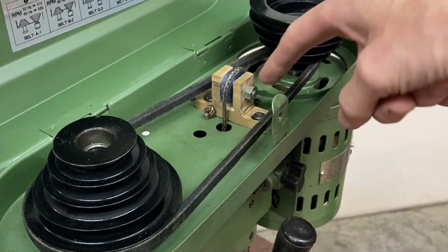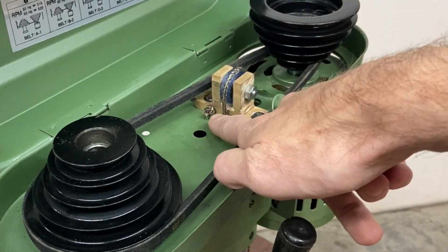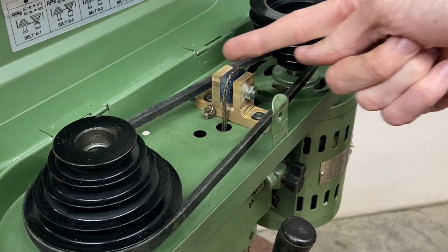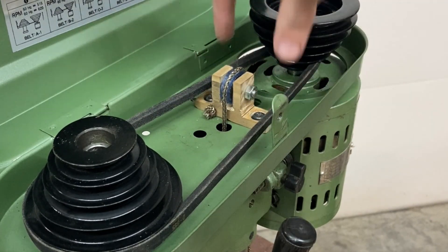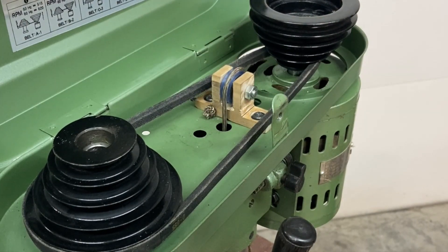The static end of the rope comes up through this hole behind here. I cut a groove in the bottom underside of this wooden block at an angle so that my knot comes out over here, and that knot keeps it from pulling through. With the screws clamping down, it actually clamps that rope tight. So it works really well — I'm pretty happy with it.